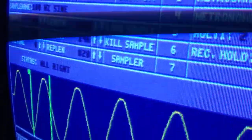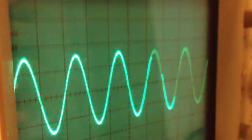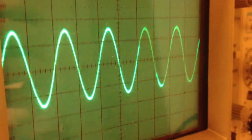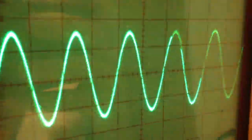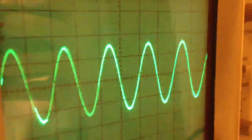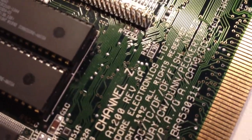So here I'm playing back a 100Hz sine wave in ProTracker at full volume. Let's check the scope. I'm probing right at the output of this RCA jack, and this is revision 1D — the motherboard that is not distorting. On the scope we're getting a sine output; the scope is set to 200mV per division, so around 600mV peak-to-peak.